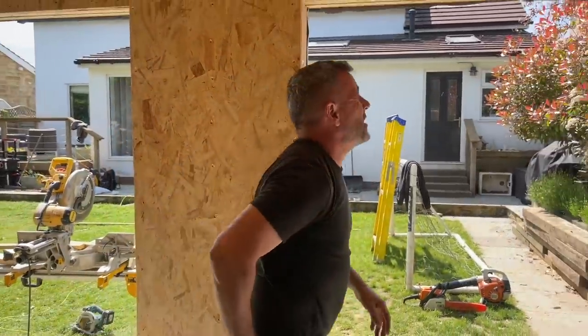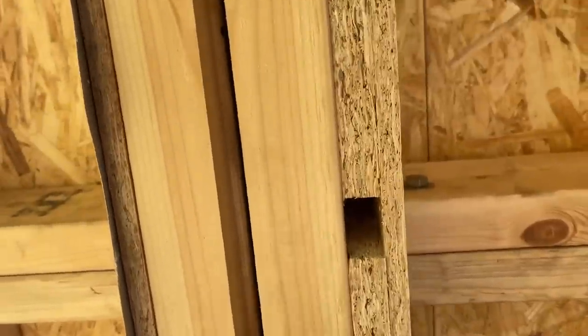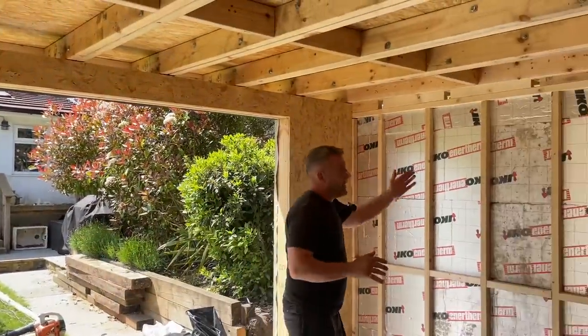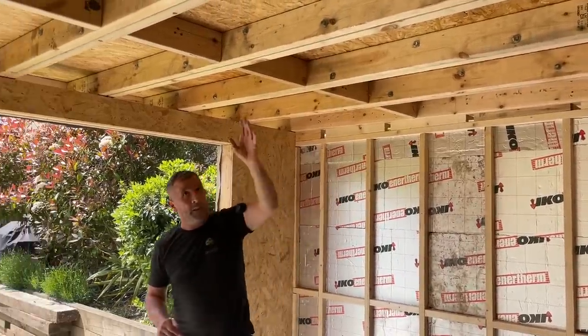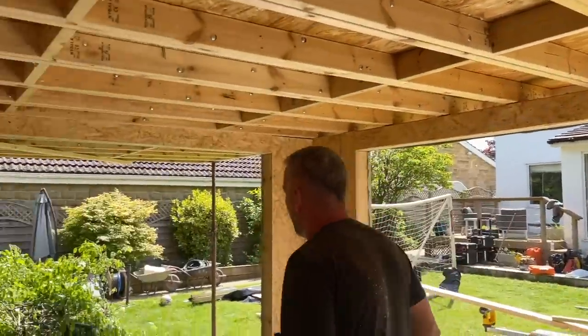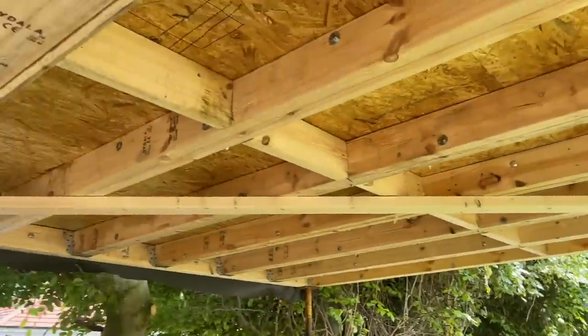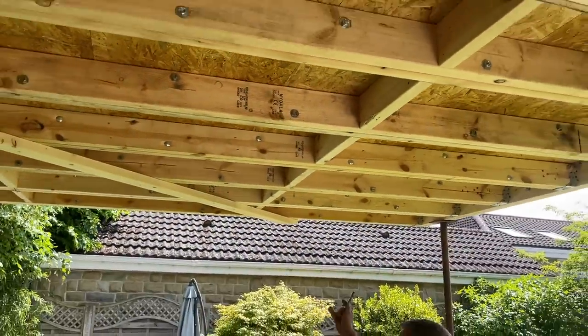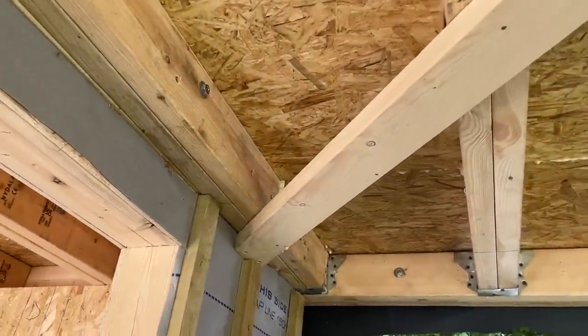Because we've flitch-beamed this section and bolted it, we've had to pack it out with some roofing OSB so that when we plasterboard it all runs through nice and straight. So you've got single brace off the wall which is fine over that span, then flitch, double, flitch, double and so on. Now let's talk about the canopy. The canopy itself we haven't gone with flitch because I'm trying to keep the weight down, and this will not be plasterboarded so there's no risk of it cracking. We've gone with double timbers bolted together and I've put a diagonal brace at 45 degrees against the side of the building to stop it twisting.